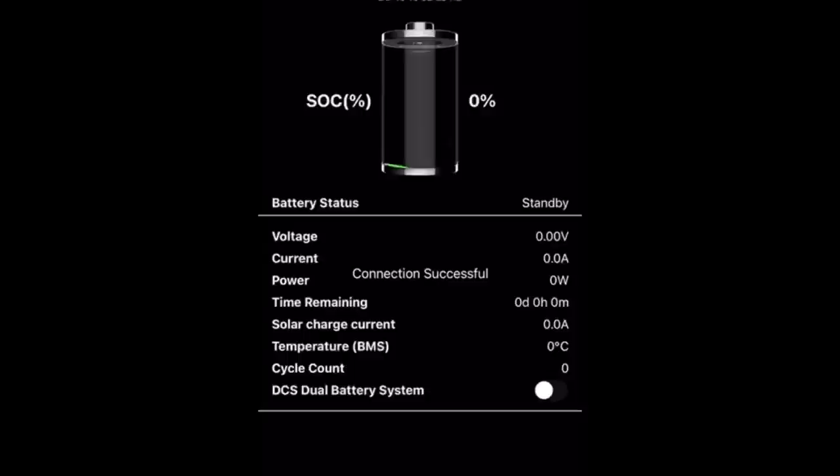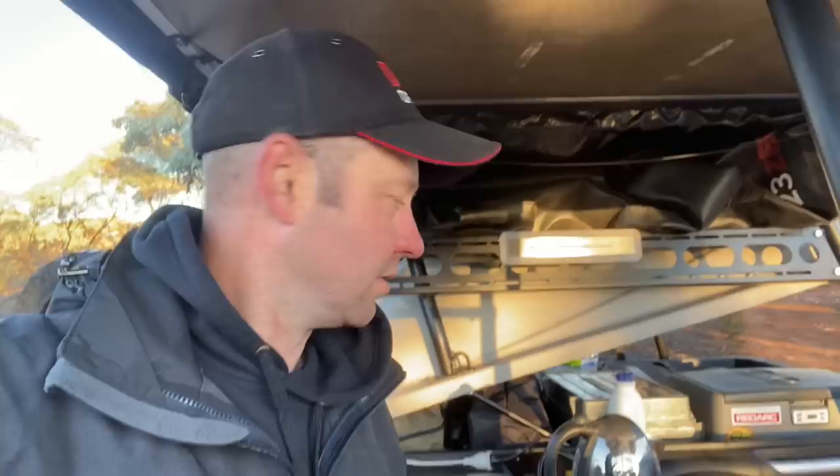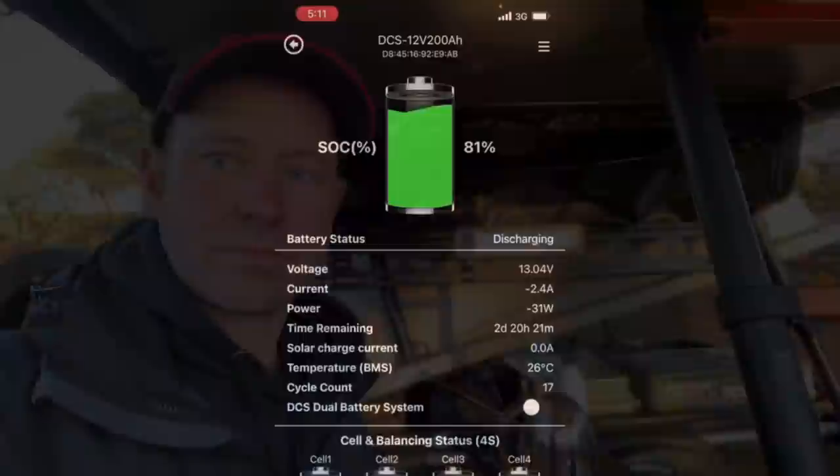One liter of water, click - timer has started, inverter is humming. It's been a bit of a fail - overcurrent from the battery. It was pulling 2.7 kilowatts out of the DCS battery. I've just started my car which will kick in the DC-DC 40 amp charger and we'll have another go. I can hear the kettle starting to boil.